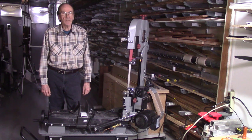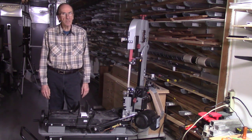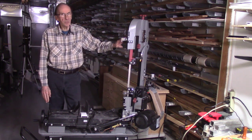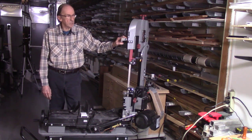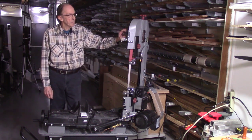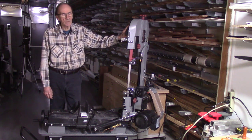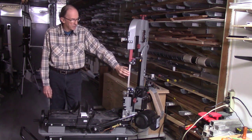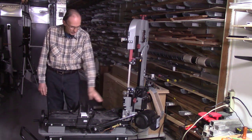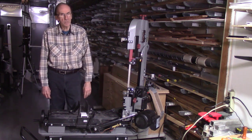I'm producing this video due to the numerous inquiries I've had on installing the Accu-Path on a horizontal bandsaw. As a result of those inquiries, I designed and tested two different installations of the Accu-Path system on my horizontal bandsaw. Mounting the Accu-Path on the top metal housing of the bandsaw was probably the most useful of the two installations. In this case, the Accu-Path projects the beam down to the bandsaw blade, down its teeth, and onto the work surface. And that works fine until you get the blade close to the work surface.